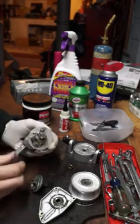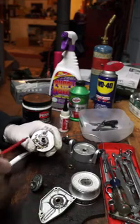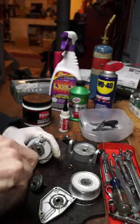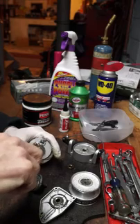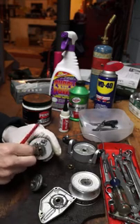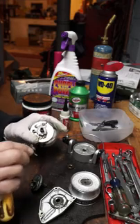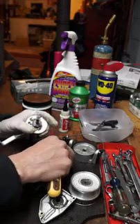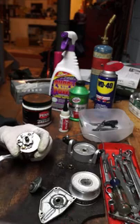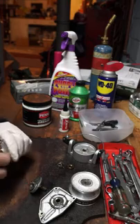I would like to check these for dirt and make sure that everything is okay there. If that is the case, we'll remove the anti-reverse dog, which is a flat-headed screwdriver. This one has a friction anti-reverse. It has two pieces of metal that grab and come back as it's returned. Again, I like to lay these down in the orientation that it came from and the associated part next to it so that I am aware of it. Next off is the assembly for the anti-reverse.